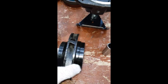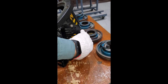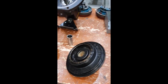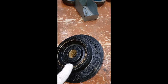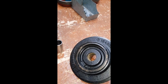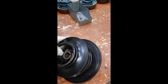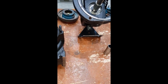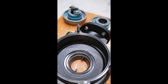These are the vanes and shrouds. This is the bearing housing, and then we have the stuffing box with the parts that will be explained now. Starting with the wearing ring: we have four wearing rings — two in the impeller, one in the casing, and one in the stuffing box. This is the wearing ring of the stuffing box. The function of the wearing rings is to protect the casing and impeller from damage. They are replaceable — they can be changed rather than replacing the whole components.